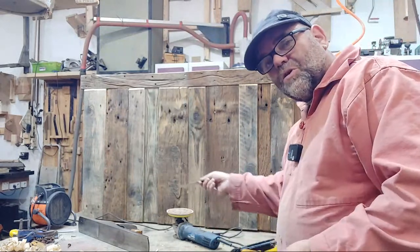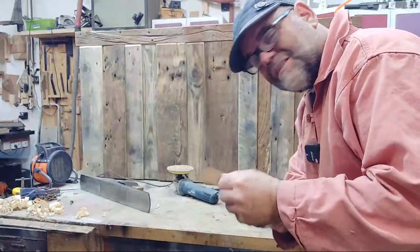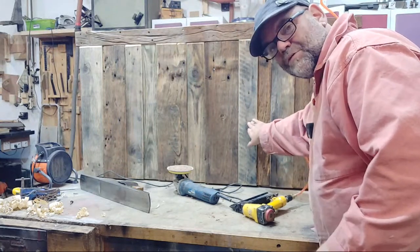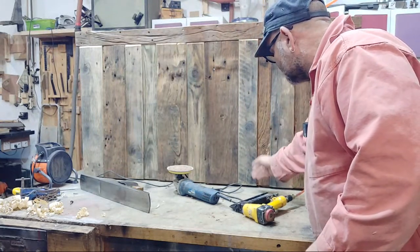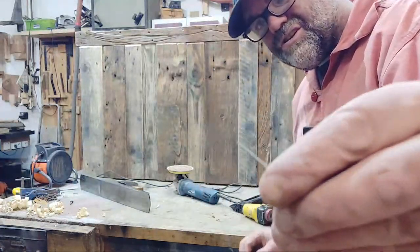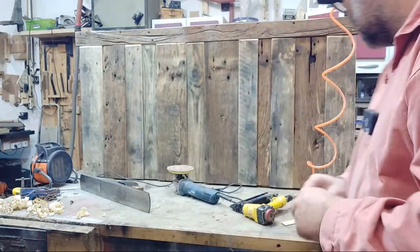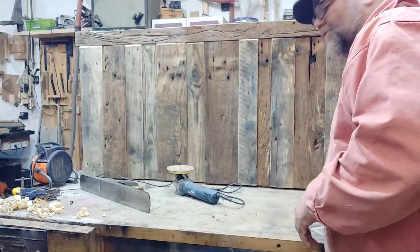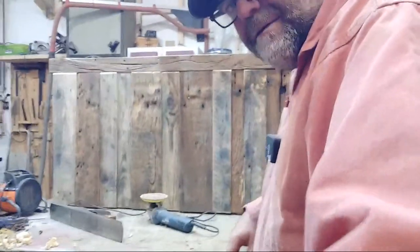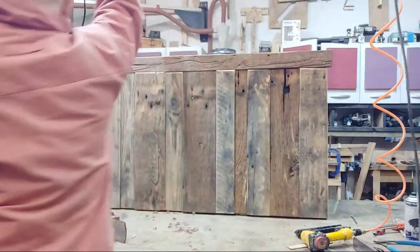But it's the bottom edge you've got to watch out for along the bottom here. As soon as you start dragging this about, it's got nails like this. If they get caught anywhere, I know it's not fixed properly yet anyway, but they'll just pull the boards off, because these aren't ring shank nails, so there's no grip on the sides at all. They'll just eventually pull out. So they're okay, they've got their uses, but definitely not for that. So now I think it's a good idea to start screwing the boards on.